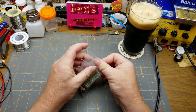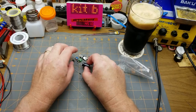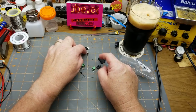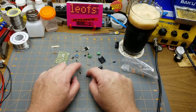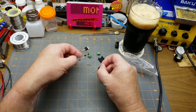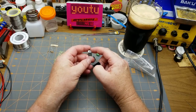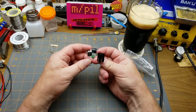So this power supply kit — let's dump them out and see what we've got. Some resistors, one big honking capacitor, a power transistor — this is the guy that's going to be doing all the work — and there are two smaller transistors that'll be telling him what to do, a couple of plugs, a little diode, and four heavier diodes which are probably going to be a bridge rectifier. It comes with a heat sink and even a screw for it. The heat sink's tapped — cool.